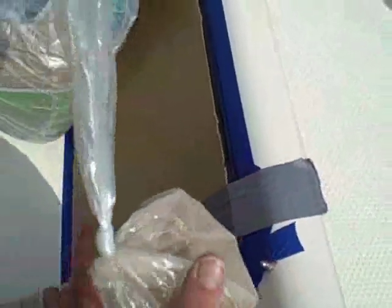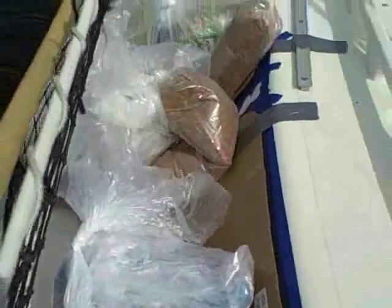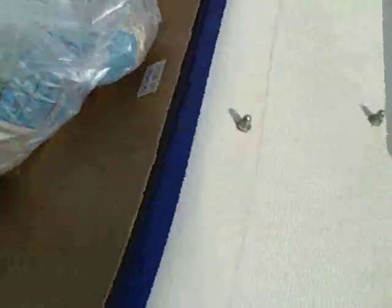The window's in place. I use the tape to hold the window up and I use the sandbags to hold the window against the deck. Now I have the sandbags and the window in place. It looks like I have a good ooze coming out — it was liberal. Let's go inside the boat and check what it looks like inside. You can see I've got it coming in, so that means I have a good seal all the way around.